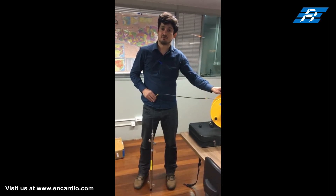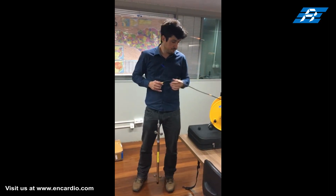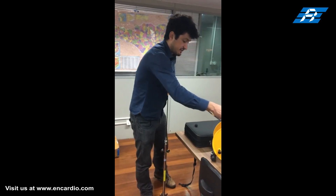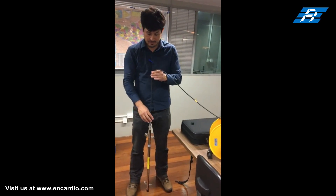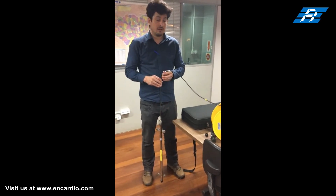The cable has ferules crimped at every 0.5 meter to take readings at standard gauge length intervals. It has a central high-strength Kevlar core that makes it stretch-proof even with intensive use. For logging data, the probe is lowered into the gauge while keeping the topmost wheel in the reference groove marked A+, which is in the direction where maximum deflection is expected. The probe is then gradually pulled up, logging data at 0.5 meter intervals.